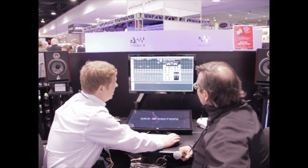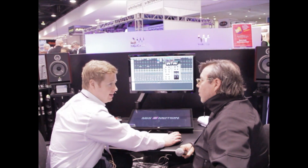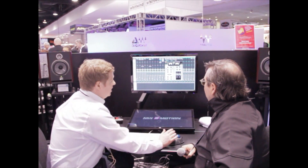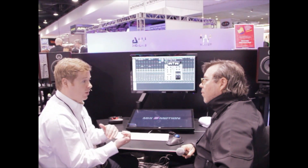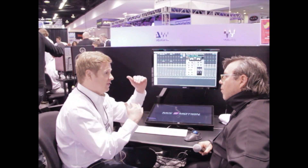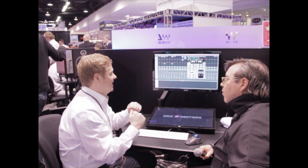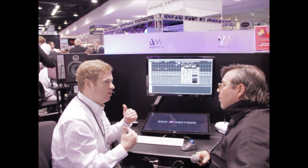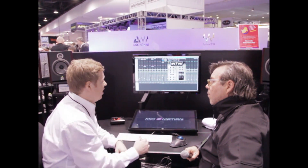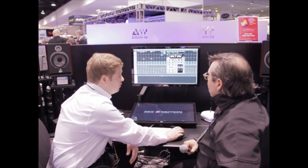You don't have to use it that way if you feel like it's messing with your stereo image, but we do give you the option to recreate that sound by having the left channel on channel 1 and the right channel on channel 2. You've got a gain knob. The extra EQ settings really relate to the pop and classic setting that we have here, which actually do change the behavior of both the tone high and tone low parameters. The pop setting turns it from a shelf — a nice gradual shelf — into a bell curve, and the tone low parameter gets boosted a little bit more aggressively as well. The drive knob is a different type of distortion than what's on the 17.